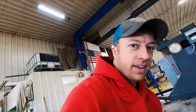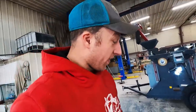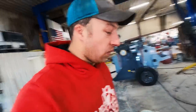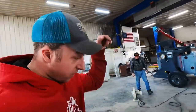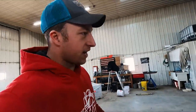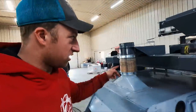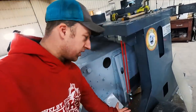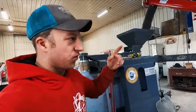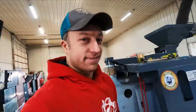Now, one thing we're gonna have to do is break out this screen right here. The reason is this is gonna get full of feathers and twigs and all kinds of stuff, so straw. We want that material to go through the fan. And you know, okay, I know you could get one of those centrifugal dust separators, the little cone that the dust swirls around and drops down. The problem why we don't wanna do that is then we would have to have a containment for it, because there's three openings in those units. So there's the suction coming in. Say you went into one of the spiral centrifugal drums. Well, then you gotta have a container to collect the heavy material on the bottom. And then you gotta have another opening where the fan attaches to for the clean air to go through the fan. Well, we don't wanna do all that. So we're just gonna let it go through the fan and shoot it out. And we'll see what happens.